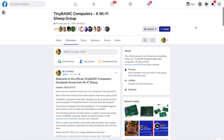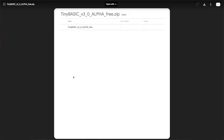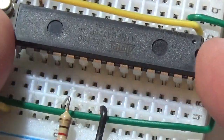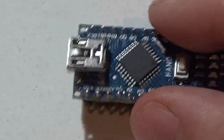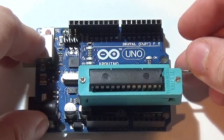To get hold of the ROMs, after joining our Facebook group click the download link at the top of the group page. This takes you to a Google Drive where you can download and unzip a file containing two hex ROMs. One is the basic kernel to be flashed to one nano, and the other is a single video kernel for the other nano or, if building the secondary system, the Atmega 328p. For nanos attach via USB to your Windows PC; for the 328p use a modded Arduino Uno as shown in the linked video.